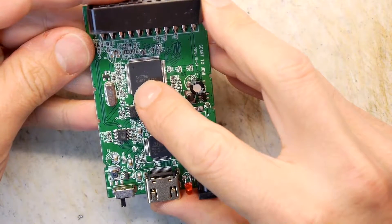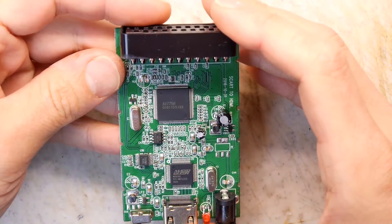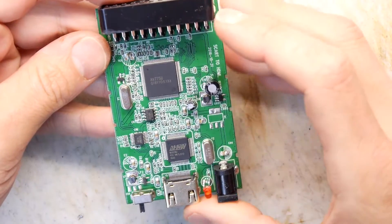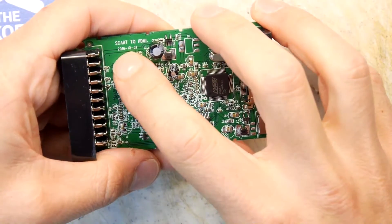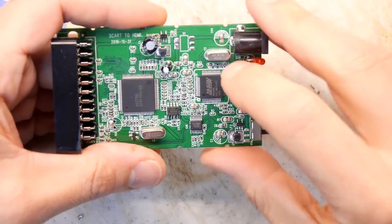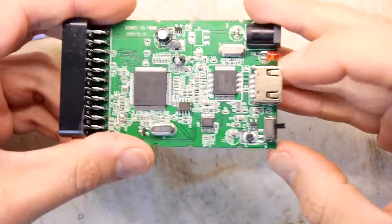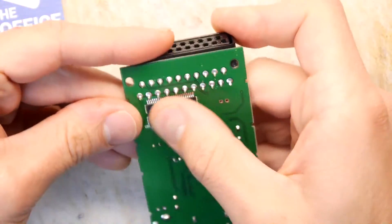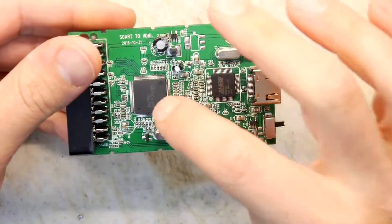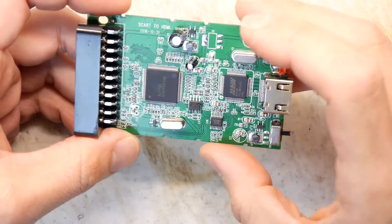The chip on the top is an AV775B — not sure what that is. And then at the bottom: Macro Silicon, MS9282. It's got a few bits and pieces. It says SCART to HDMI, 2016, 10th — wow, recent. There's a 24 megahertz crystal, and a 24.57 megahertz crystal here. So you've got a timing crystal for the input and a different timing crystal for the output. Nice little switch there. And on the back, a Samsung K4S161622H — so that will be a flash. It's probably, I would be guessing, an FPGA of some kind, just loading its software straight in and then off it goes.